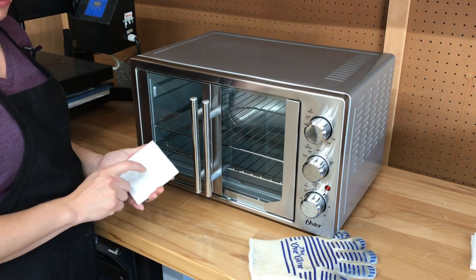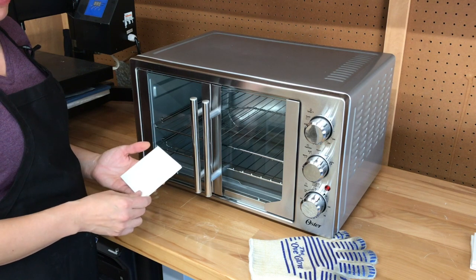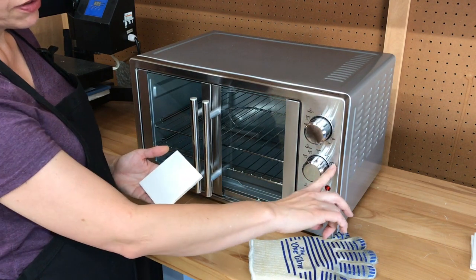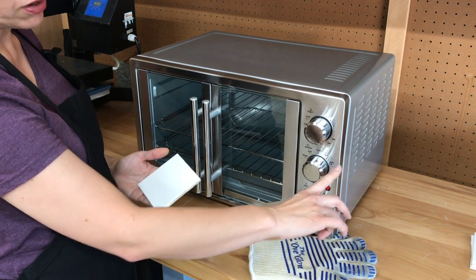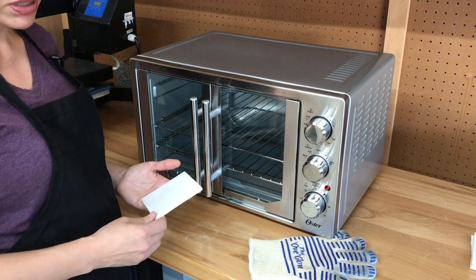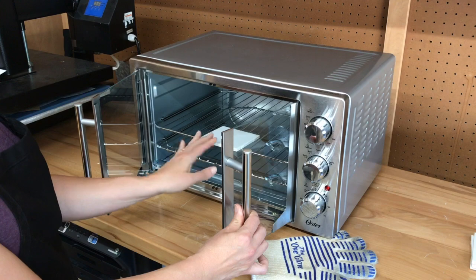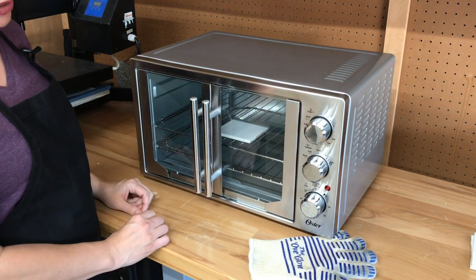The coating is totally dry — it's nice and hard. I'm going to cure it in this convection oven, which is already heated up. I'm setting it at 300 degrees for 22 minutes because it's on the turbo setting, which is the same as the convection setting and heats up faster than a standard oven. If you're curing yours in a regular kitchen oven, you'll need to be at 340 degrees. I'm going to put this in and set my timer for 22 minutes.